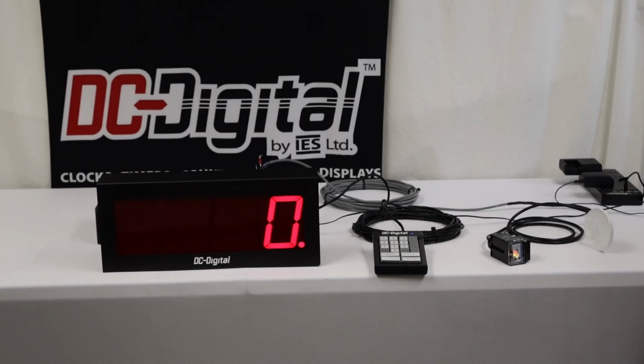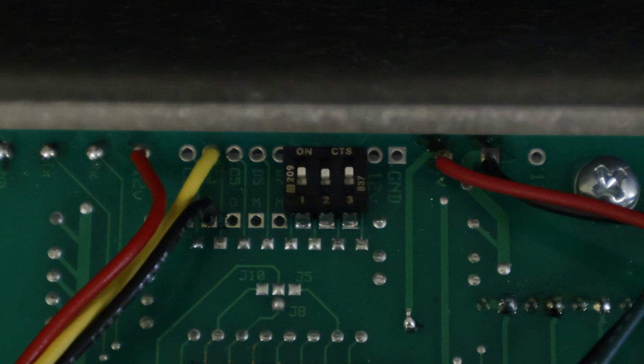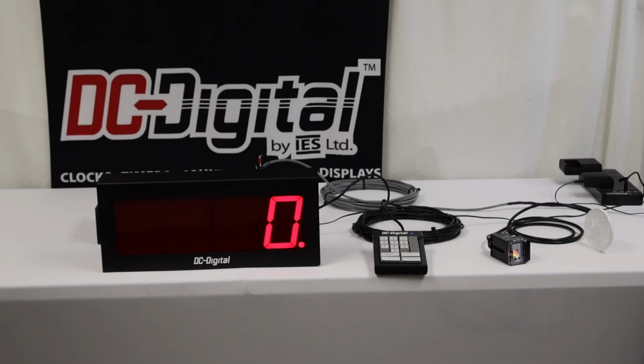Given the nature of the durability testing machine, the anvil going up and down, and depending on where the photo eye is placed, it can require one of 3 scenarios. If the photo eye is placed at the top of the anvil so that it is only breaking the photo eye at the very top of its upstroke, then it can count every single time. And that is set by dip switches inside the timer here. So in the position where all of the dip switches are off, it will count every time.